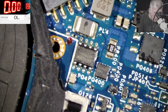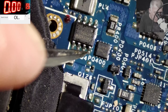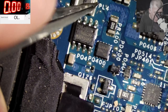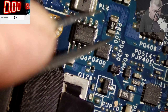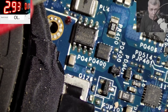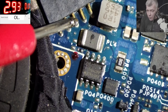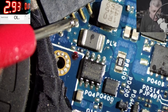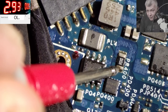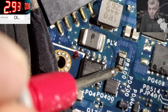So the schematic is like this: we have the charging port, then an inductor, first MOSFET, second MOSFET, current resistor. It's normal for those two MOSFETs to get hot when you apply current here. Coming in with the current — check the screen — 3 amps, that's the current limit, and the voltage is 1.7 volts, so you're losing 1.7 volts somewhere. Where? On the MOSFETs, because the short is after those two MOSFETs. If I come with current after them, the voltage is 0.5 volts. So I'll lower the voltage to 0.89 volts — same 3 amps. Let's see what gets hot.